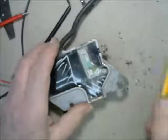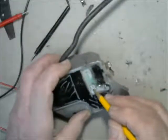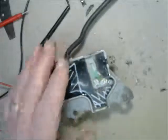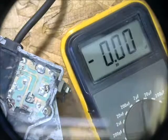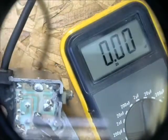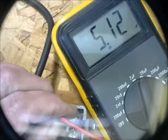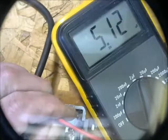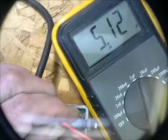I cleaned off the solder a bit first, and now I have a little space between the actual capacitor connector and the ground copper strip on the printed circuit board. With the capacitor disconnected, let's see what the meter tells us. It reads 5.12 microfarads, so the capacitor is good — that's probably the most reliable indication of anything. Between the meter reading and earlier testing, the capacitor is confirmed good.